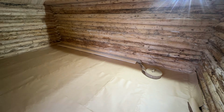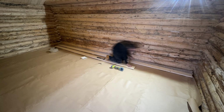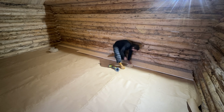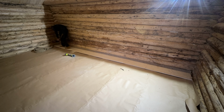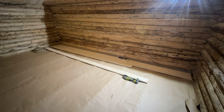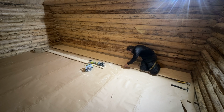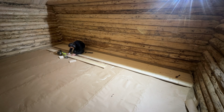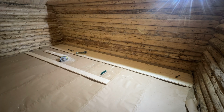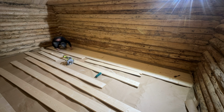Welcome on board. I might just make it today. For floorboards I use spruce. They are 3 centimeters thick and 15 centimeters wide. I discovered that the boards were getting curvier and curvier, and I came up with a solution for that. All credits for this solution go to my personal consultant from all the way overseas in the Netherlands, my dad.